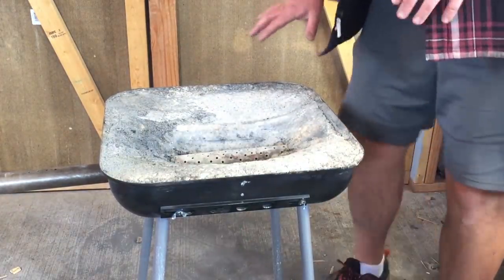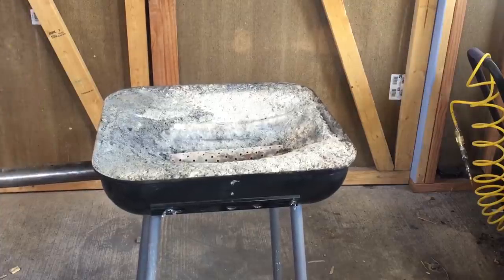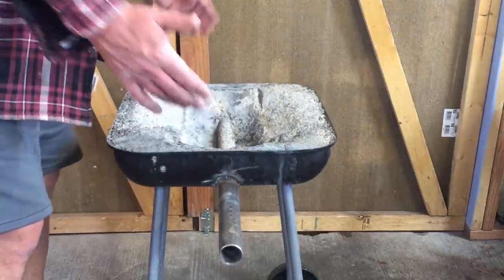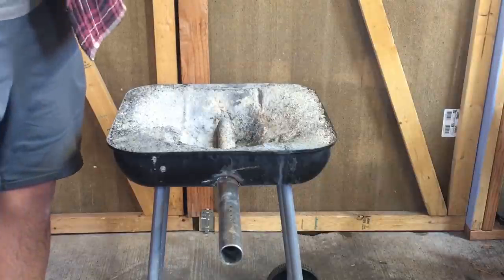The design that I used used a very, very light refractory material. Make sure that the forge you're building is built in such a way that it is not going to collapse. So this pipe allows air in — that's one of the keys to making an effective forge. You have to get a lot of airflow going through there.